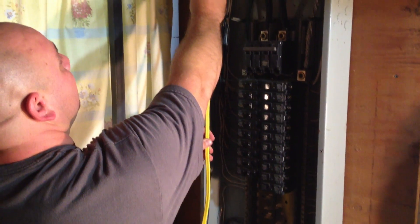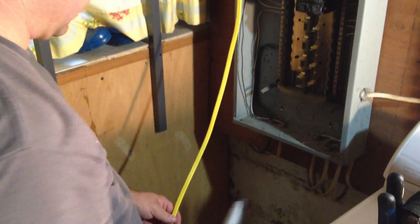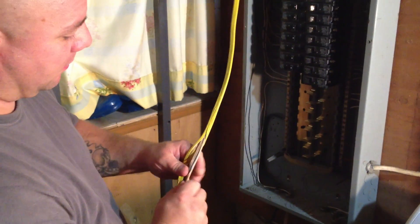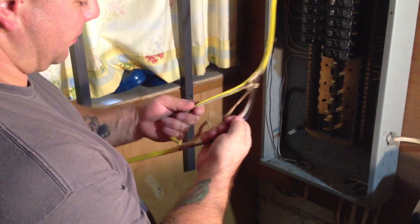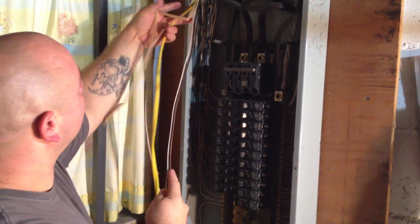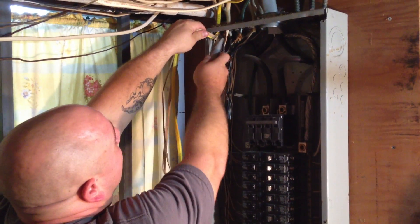So now we have this wire in the panel and we have to slice it down. Get down to the bottom, open up the casing, and pull that wire out. You got to be careful cutting this wire down the middle — you want to cut it because that's where the ground is. If you go too deep into that casing, you're going to slice either the black or the neutral, and if it's exposed and touches anything metal, it's going to arc inside that panel, which is not good. So we pull the casing up all the way to the top and we cut it.